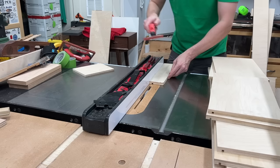Since I'm reusing the existing small drawers, they have little dividers — and there's a middle divider right in the center of the drawer which prevents you from tightening the screw in the back of the knob. What I'm doing is pushing against two protruding screws to make two indentations on the back of the drawer front, so I can pre-drill the mounting holes. Then I push a screw through to the drawer box itself, where I cut a little recess — and in that recess will sit the head of the screw on the back of the knob.